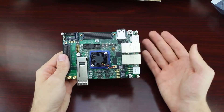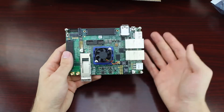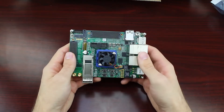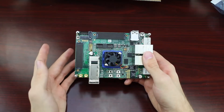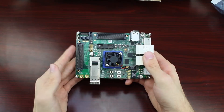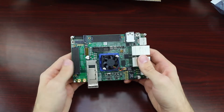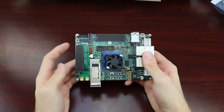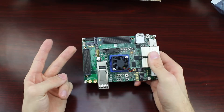But don't let that small size fool you, as the board is quite powerful. It features the most powerful Zynq MPSOC — that is the Zynq UltraScale+ EV MPSOC. The great thing about that particular Zynq device is that it contains an integrated H.264/H.265 video codec, capable of simultaneous encoding and decoding up to 4K by 2K at 60fps. This makes the board particularly great for embedded vision applications such as ADAS, surveillance, and multimedia.